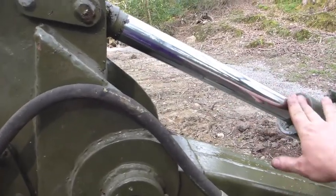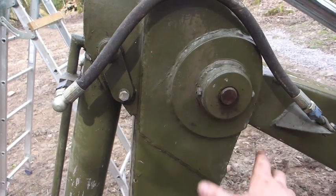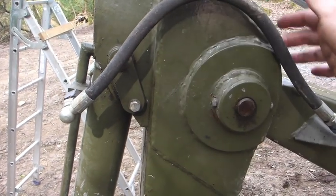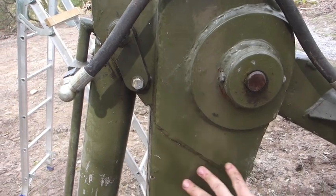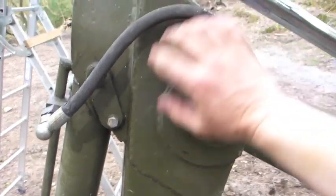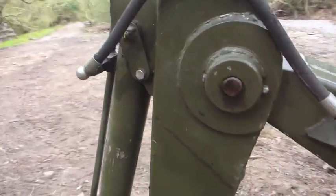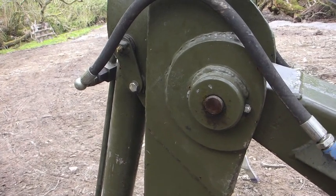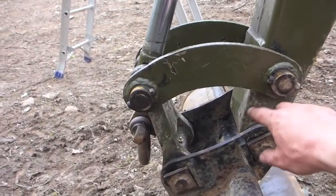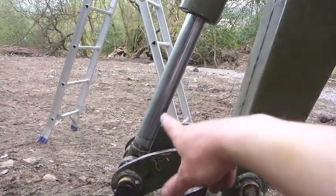Very big powerful rams can do a lot of damage. This is typically a part of the Tusker that suffers. If you look at the parts catalogue, as the marks of the machine increased with age, this is a Mark III dipper which I have updated to a Mark IV modification state with these strengthening plates. When I got my machine, this bush was completely torn out and badly welded back on with pigeon poo. So I've updated the machine and strengthened this area here.